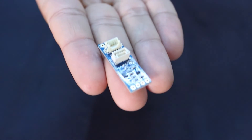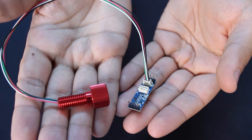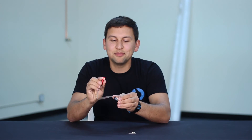A leak sensor like this is great on any underwater project. Our next new product is an I2C level converter for the Bar 30 pressure and depth sensor and the Celsius temperature sensor. Both of those devices can only communicate with 3.3 volt logic, which makes it a little difficult to communicate with a 5 volt device like an Arduino Uno. The new level converter plugs directly into both sensors and provides header pins to connect to a 5 volt device. It converts the I2C communication to 3.3 volts and keeps the sensor happy.